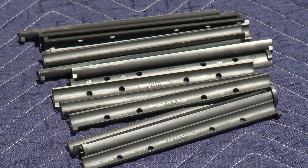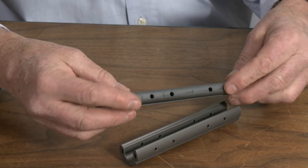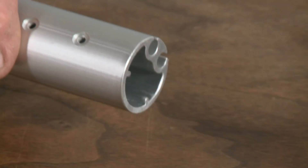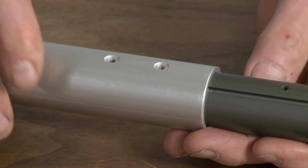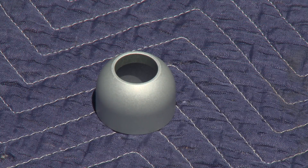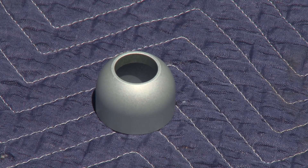In another plastic bag are a series of nylatron bearings. This is a two-piece nylatron bearing that gets installed over the wire and inserted into the C-shaped extrusions, then put inside the furling extrusions themselves. The purpose of the nylatron bearing is to isolate the aluminum components from the stainless steel wire or rod that forms the headstay. One of the smaller parts is the top cap, set with two Allen screws, which finishes the extrusion at the top to prevent chafe on the halyards.